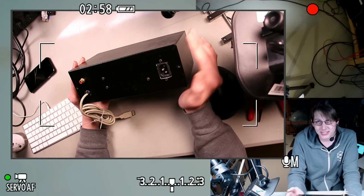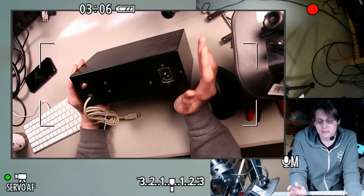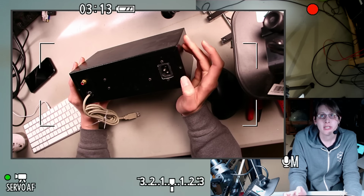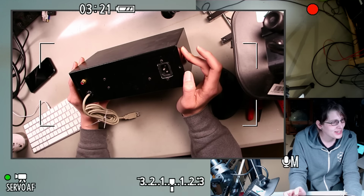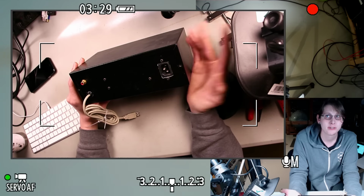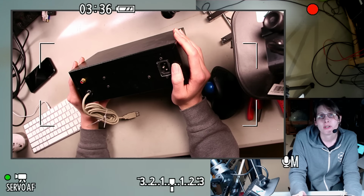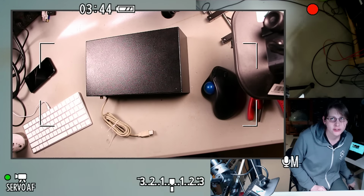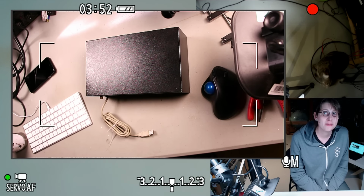So at the time, I was still in that really low-end tier of silicon that only had access to that 1.5 megabit speed. Because they were really bending over backwards to support these really low-end devices, there are some significant protocol differences between the low-speed and the full-speed devices. I should actually make sure that I talk about all the speeds and I don't get ahead of myself. So speeds. Low speed was 1.5 megabits, full speed 12 megabits, and full because that was from the original USB spec. When USB 2.0 came out, that's what added the high speed spec. So USB high speed is 480 megabits per second, and that was the maximum speed all the way until USB 3 came along with their 5 gigabit and then later 10 gigabit modes.